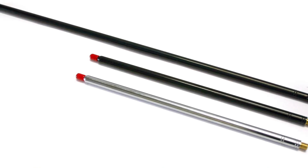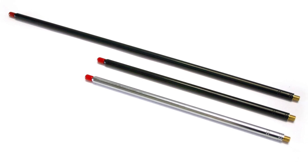We can also make full-size dipoles — that's easy to do. We have very lightweight, rugged antenna arms in different lengths. More experienced users who want a full-size dipole on 20 meters will get more bandwidth and more efficiency. We compare ourselves to a full-size wire dipole. Even with the shortened 16-foot version on 20 meters, we're only down 1.04 dB — you can't tell with the naked ear. With longer telescopic whips going full-size, there's zero difference between our antenna and a full-size wire dipole.